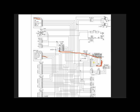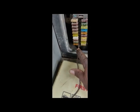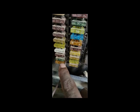I have removed the switch from here — power is not coming to the fuse. What I did is put a wire from the switch ACC point and connect it to fuse 20. You can see I have fixed one wire just to check if my screen comes on. I put this wire from the ACC point to this fuse — it's called the ACC fuse, a 5-ampere fuse. Now I'm going to turn on the switch.